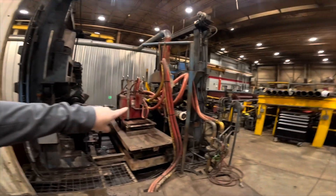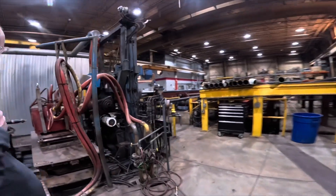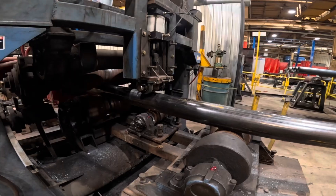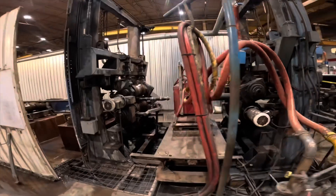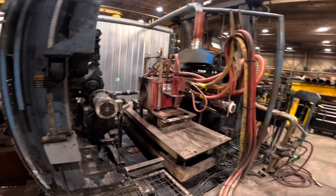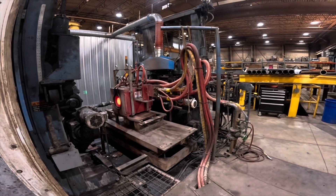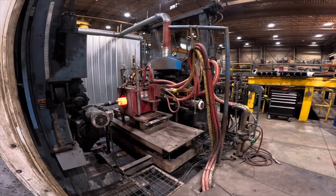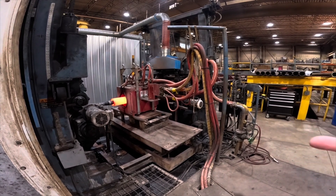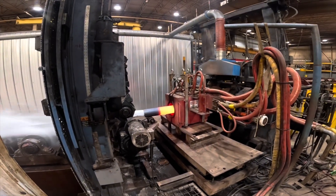That pipe is being fed through right now. There's a little wheel right there that leaves a mark on it — we'll get some video of that in a minute. You can see it going through and hear that noise — that's the electromagnetic coils. If we started counting when it went through there, it's probably about 15 seconds. You can see how hot that is. Now that water jet's going to start any second — see it blasting out the end, see how fast it's cooling the pipe.